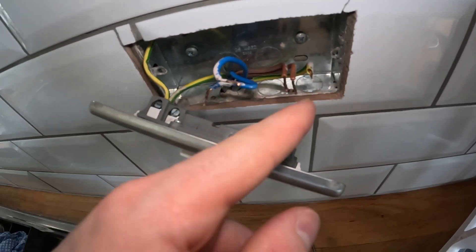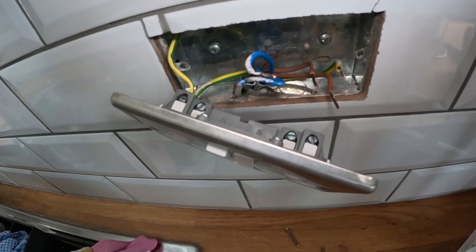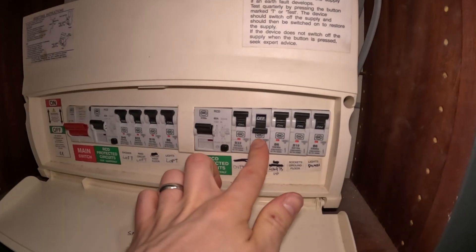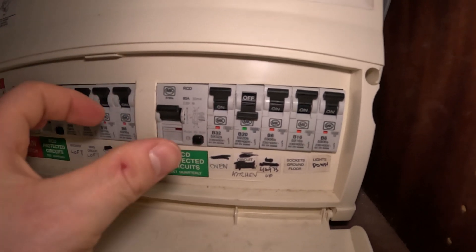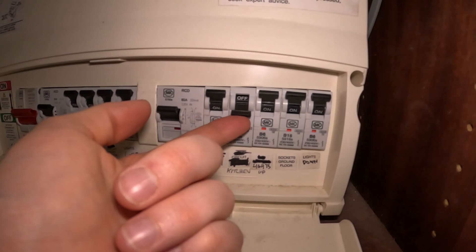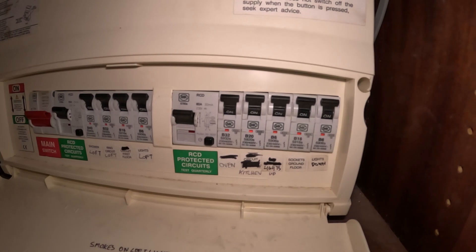Now I've got all the cables separated so that when I put the power back on, I know that it won't go any further than this socket, but the incoming cables on these will still be live. I'm going to flick this breaker back up — if this RCD trips, I'll know the fault is on that half rather than the later half of the circuit. Flip that back up. Okay, it hasn't tripped. So I know the fault is in the later half of the circuit. I'm going to go and do the same thing and split the circuit further down.